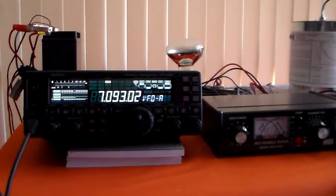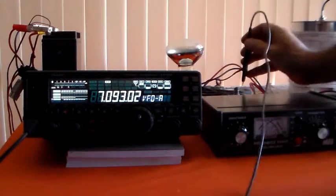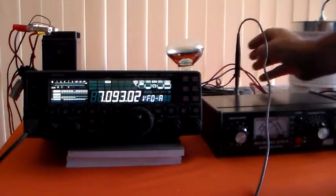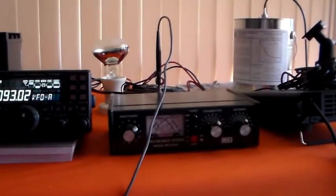So you can see with full modulation there, that light bulb is getting considerably brighter with the modulation. That's showing incremental modulation. I'll just show you what that incremental modulation looks like on an oscilloscope. Got a little high impedance takeoff point there, so just so I can see the output waveform. Now all I need to do, the filament's cooled down again, so it's going to get a little alarm just for that second until it gets to something like 50 ohms again.